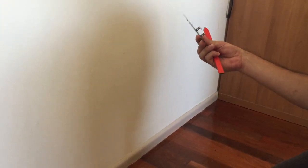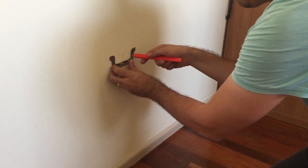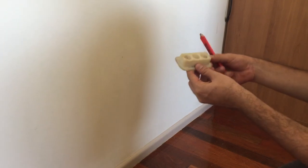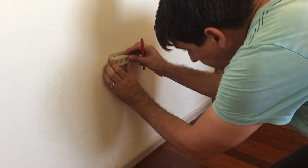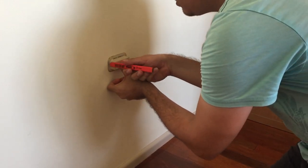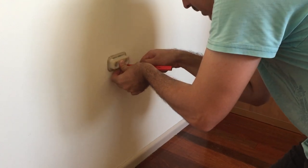I can take a c-clip and put it such that the mark I've made is at the center of the c-clip, and I can actually trace around that. In this case I've got a template — a little spirit level that provides a template you can draw around. There are also cardboard versions available, or you can just measure it up and trace around that. So I've now got a good clear mark of exactly what I want to cut.